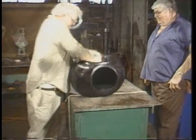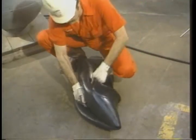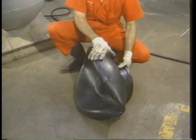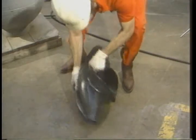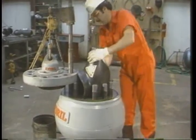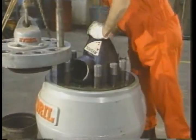The Hydril and Continental diaphragms can be installed in two ways. The first, and what Hydril believes is easiest with theirs, is to lay the diaphragm on its side and roll the bottom in on itself. Using this method, the neck opening will be on the outside. You should be able to roll it up to where it'll fit in the hole quite easily.